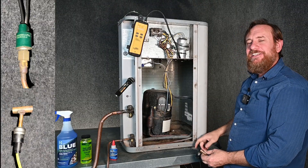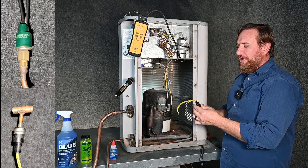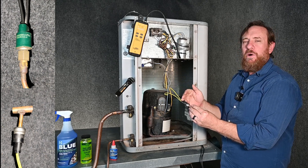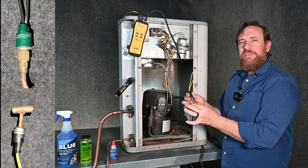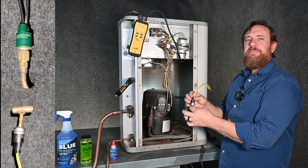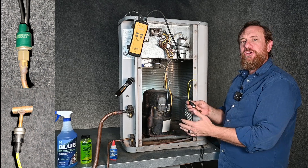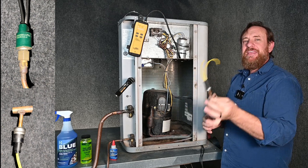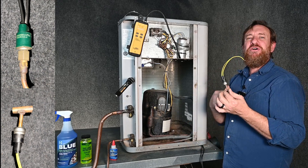Another accessory you see inside these units is a pressure switch — a high pressure switch for the high side and a low pressure switch on the low side. With these low pressure switches, you have refrigerant on one side, a little diaphragm and a very small seal, and you've got the wire on the other side. Over time, from vibrations, high pressure, and weather, these can start to wear out and leak refrigerant. By simply putting your leak detector all around these points — all around the top — it can help you find those leaks. I still like to use my electronic leak detector, but to pinpoint where it's at, the bubbles work great. You will need a mirror to look at the bottom side. These are notorious for leaking, and if you have a leaking or even a bad pressure switch, we never want to bypass it — we want to replace it.